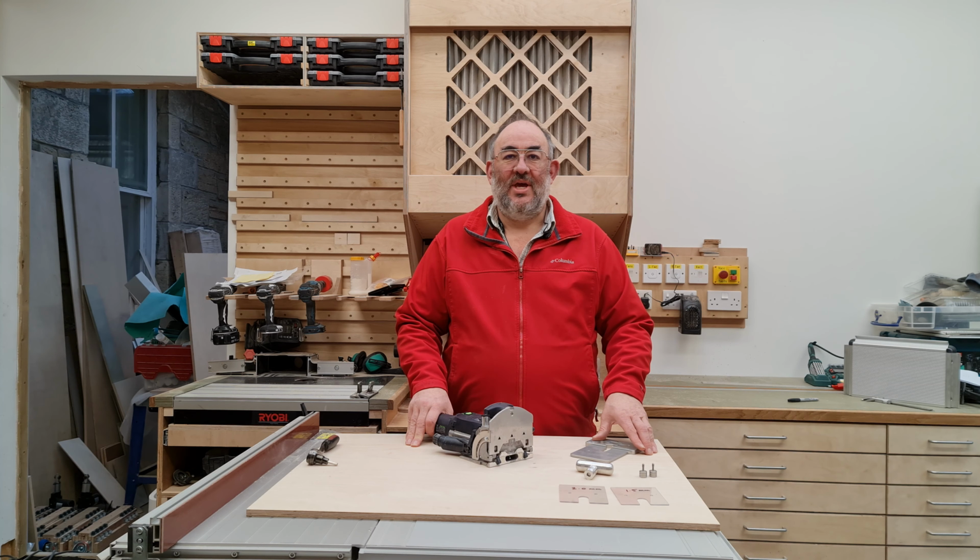With the winter weather here in Scotland not conducive to precision working outside, I've been developing my workshop as a permanent home for my tools. This has involved making cabinets, drawers and structural boxes, and this in turn has allowed me to experience the more production aspect of the Domino, where many holes are drilled in multiple pieces in quick succession. Sadly, we've already experienced the frustration of fence creep, although my Domino is a 2020 model, and we simply didn't notice things were awry until several boards were spoiled.